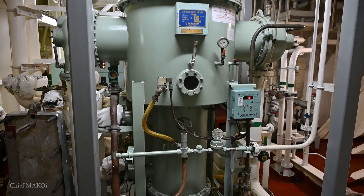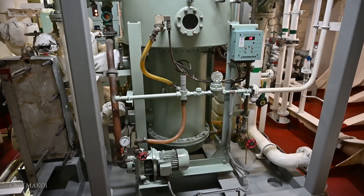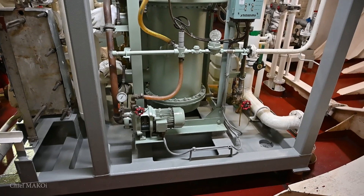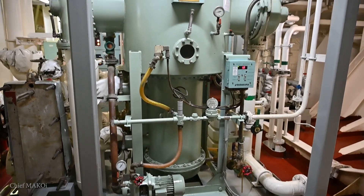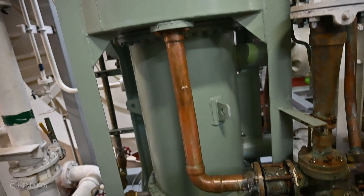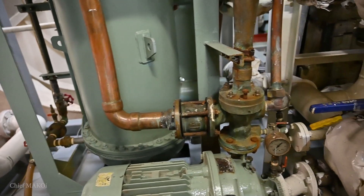In the previous video, a lot of viewers asked where does the salt go? Since this is a continuous flow system, meaning it never dries up, the salt remains dissolved in the seawater that hasn't evaporated. As soon as that seawater flows out of the evaporator tubes and into the shell, it will be suctioned by the eductor and pumped out into the sea.